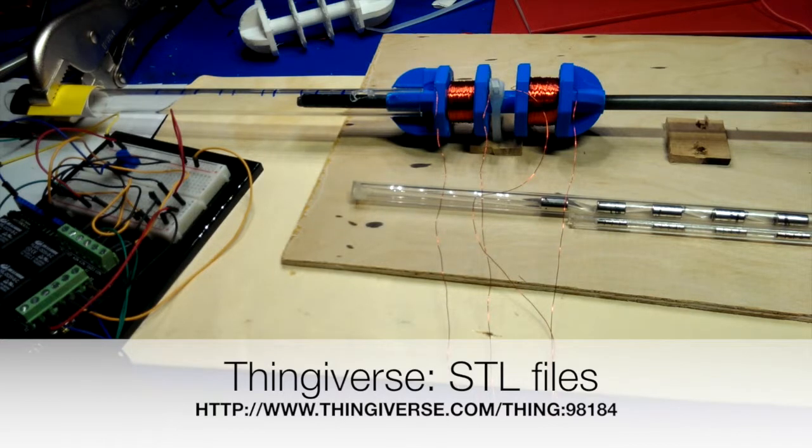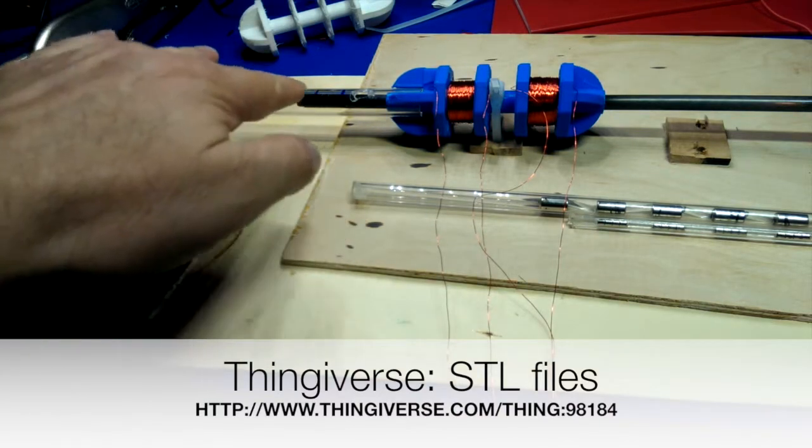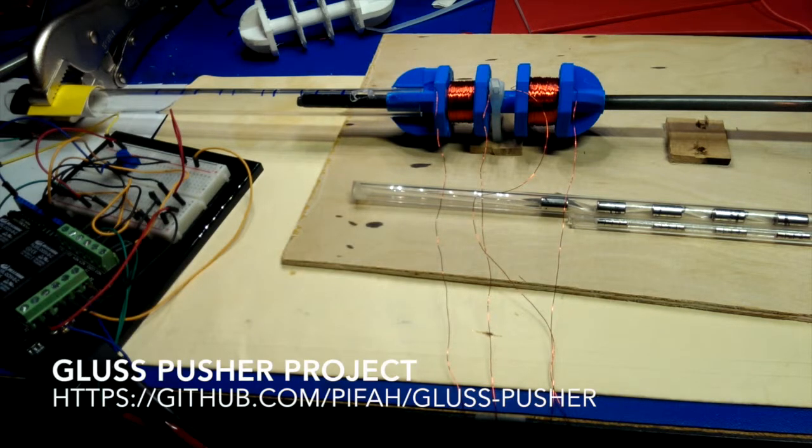I believe that today the system is very unreliable, so I'm working on an idea of using an inexpensive photoresistor to detect light in this back tube to try to make a closed loop system rather than an open loop system. Right now, if something goes wrong, if it overshoots or if a force prevents it from moving, it doesn't know how to correct itself. It's a completely dumb system. That's useful for certain applications, like if you're doing some cosplay or art thing where you're controlling it by hand, it would be okay. But for robotics, that's not really going to be acceptable. So I'm going to have to work on some kind of a sensor-based system to tell where you are.